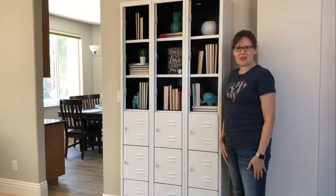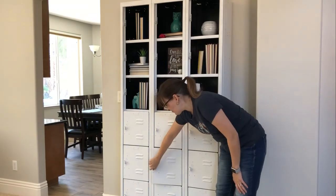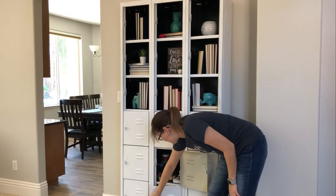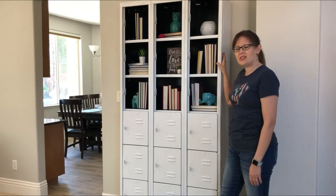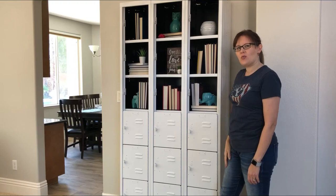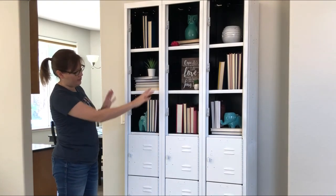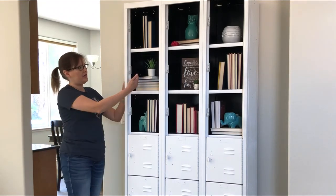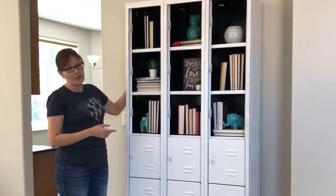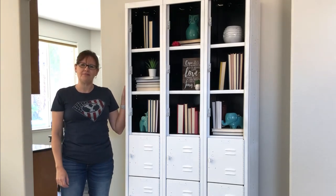The lockers are finally done. I'm really excited with how they turned out. I love that I've got the part that I can always have looking nice and neat on top, and then down here I can hide all the craft supplies and kids' homework. One thing I would suggest about these lockers: be sure to anchor them to the wall. They're really heavy, just like bookshelves and dressers that need to be anchored to the wall — this should be too, so that nobody gets hurt. If I were to do this again, I would not bother taping at all and spray all the white first. Then I would tape and be sure to tape all the holes along the outside so that the black paint doesn't go through and put little shadows on the outside. Then I would go in and spray the black. I ended up having to do a lot of repair work on the white — the black went really smoothly. I don't know why the white was harder, but I'm really pleased with the way it turned out. Thanks for watching!